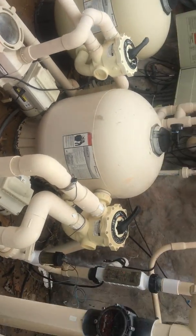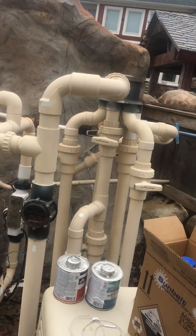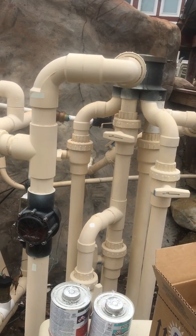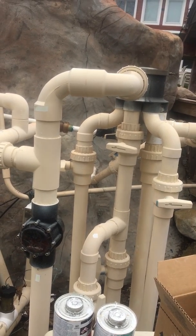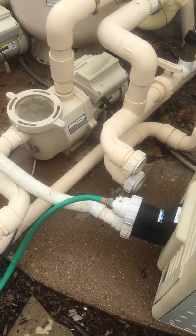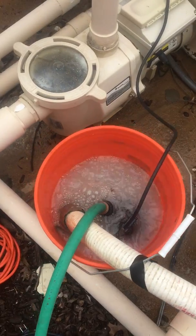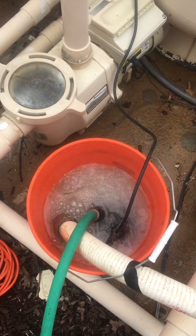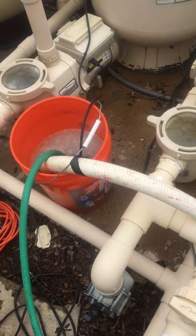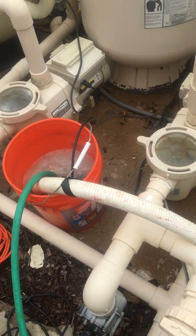I let it run for a few hours. At this job I also have a few sand changes to do in the sand filters, and I have to replumb some of the in-floor cleaning manifolds — we call them R2D2s just because they look futuristic or whatever. So I've got some time to kill. The water started out clear, and we have a lot of bubbling now and it's starting to turn a little gray or green — it's starting to break the scale up.